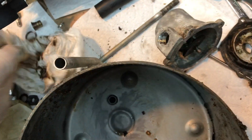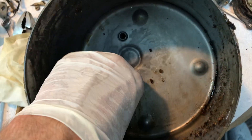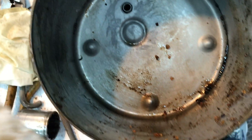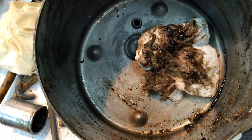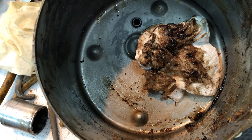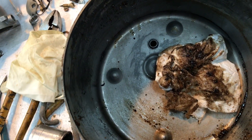You can see just a hole — no threads or anything in there. But this is what's confusing me: no provisions for a plug to fill the vacuum chamber with mineral oil to lube the leather diaphragm. First I've ever seen this.